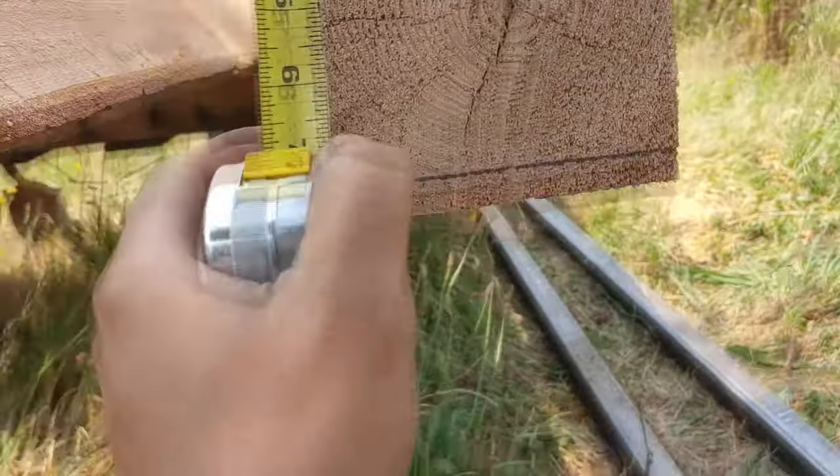And then I went ahead and took another slab out of the waste where we couldn't even get an inch out of here. But because this is a roughly 9.5-foot log, I can take 1.5 feet out of it, come back here, and actually get a pretty nice 8-foot board out of it. Again, live edge, but I got 4 or 5 inches I could rip out. I wanted to make a board and take the live edge off.